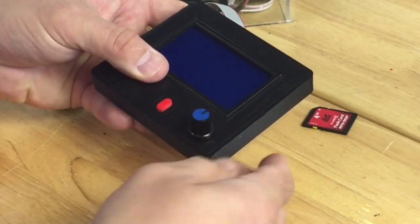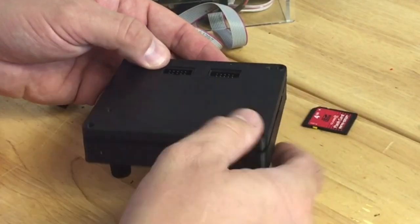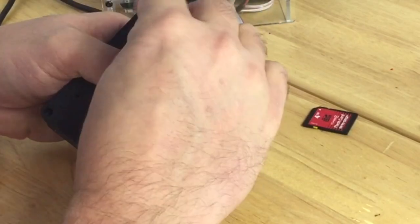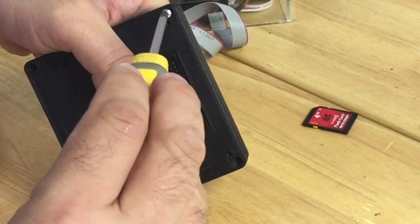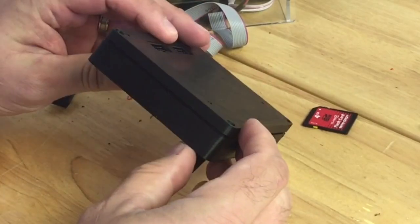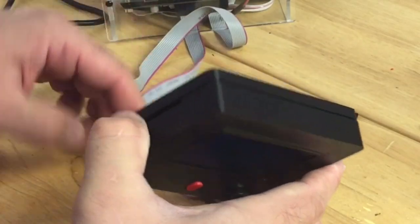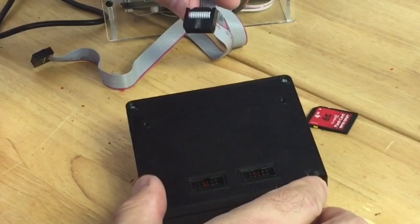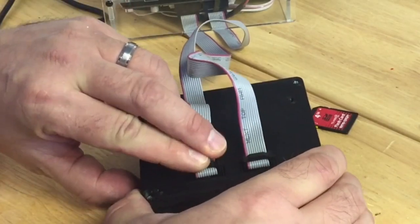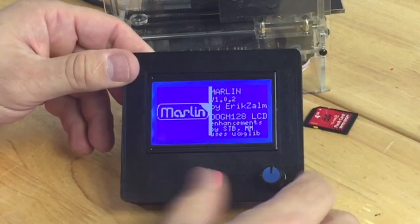All I had to do was slide the top over and then put the knob back on — mine came with a knob, though there are knobs you can 3D print. I put the back on and it fit nicely right over the connectors with a lip that fit inside the front cover. I used some extremely small self-tapping screws — I just went through my junk drawer and found four that fit perfectly. I screwed them in not too tight, because if I screwed in too tight the kill switch would press against the switch. I put EXP1 to EXP1 and EXP2 to EXP2 — it's not marked on the plastic so you have to remember. Then I powered it up to verify everything, and there it was — Marlin screen and then the information screen.